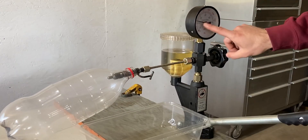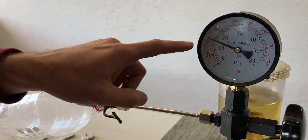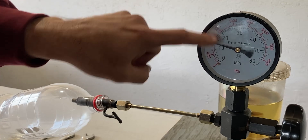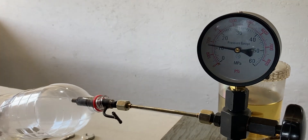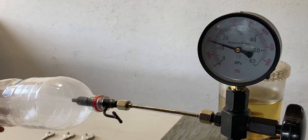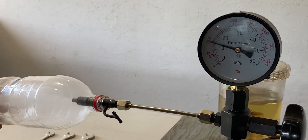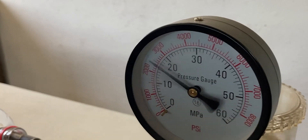Now I'm going to share with you guys a close-up on the gauge and also a close-up on the spray pattern. I'm going to start pumping and you'll see it should open up at 2800, which is close to 3000, and we have the red markings on the outside perimeter of this gauge. The pressure seems to be opening at just over 2800 PSI and then it drops back down — so we have a good diesel fuel injector.